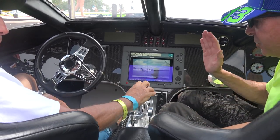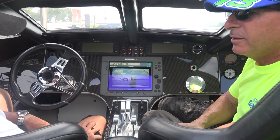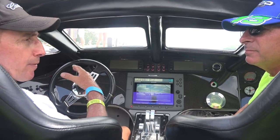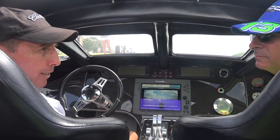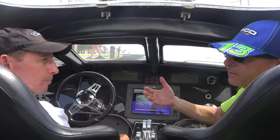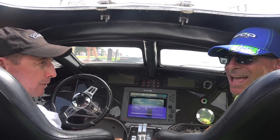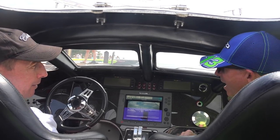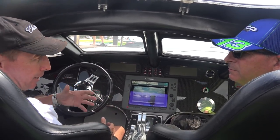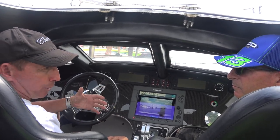And some of these terminologies like spooling up equal to turbines, right? Yes, that's the turbine. And spooling up is you have got to bring the RPMs of the motor up to where it'll continue to run by itself. And one of the questions that a lot of people ask is, what are the RPMs of the turbines? Approximately 20,000 RPMs. Wow. And you're working off percentages of the N1 and the N2 side. The drive side is the N2, and you work percentages as to what actual speed you're on.